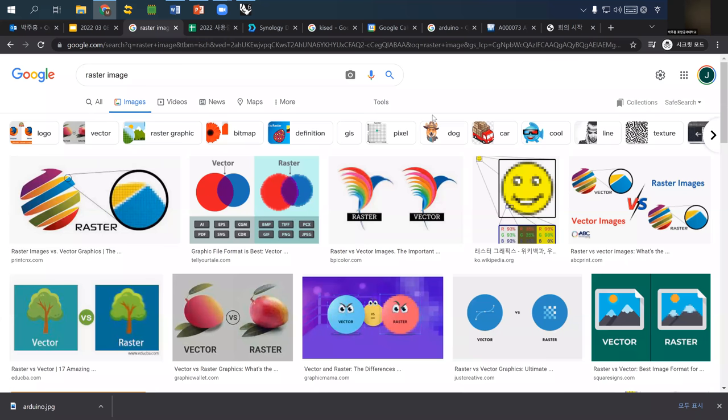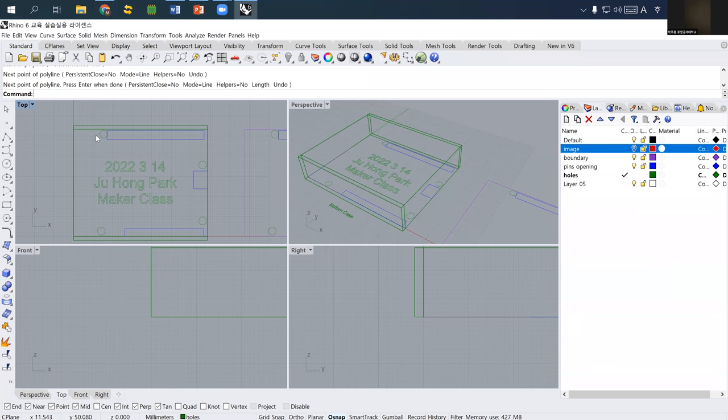And now, we have a different issue than 3D printing. 3D printing is always an additive technique, so it'll add material and make it thicker. Laser cutting is a subtractive manufacturing system, meaning that it'll melt more material than you expect. So now we need to think about this.